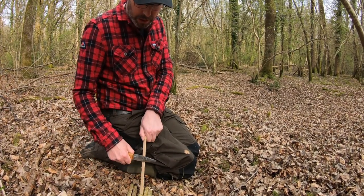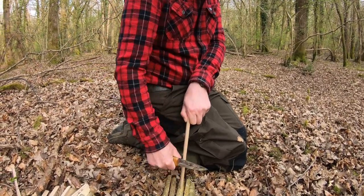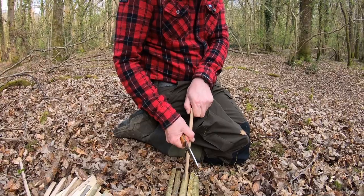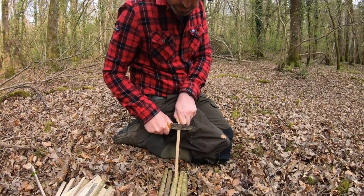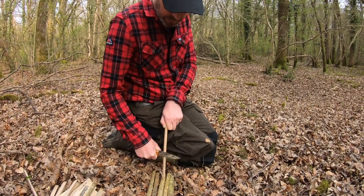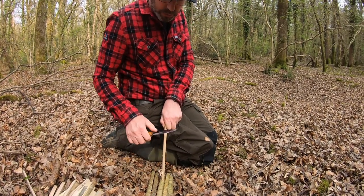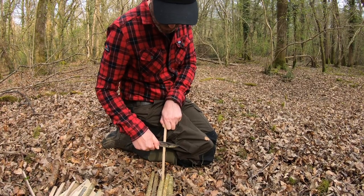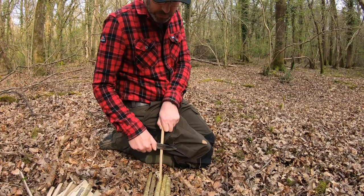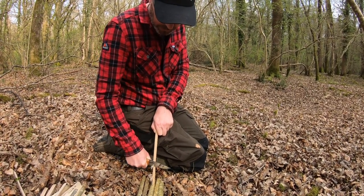And all I do is turn that. I don't normally turn the knife, I normally just turn the wood and keep the knife going down. Just lock your arm when you go down, or whatever's comfortable really. So all I'm doing then is starting close to my fingers, obviously being careful, and I'm going to go down really slowly. One side, so I'm not too worried if it pops off. I'm trying to make sure, see that Scandi grind, that it's sitting flat like that. You don't want to be too deep or angled in, so it's going to cut in deep, and if you're out too much, it's just going to pull off those bits there. And the more you do this, obviously the easier it's going to get.